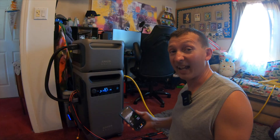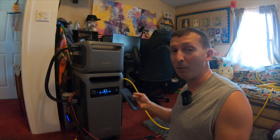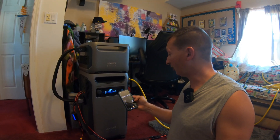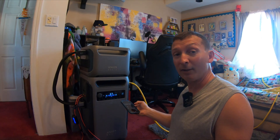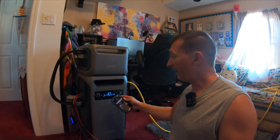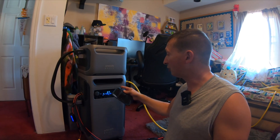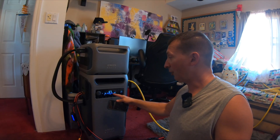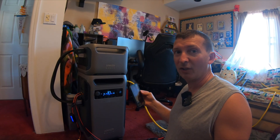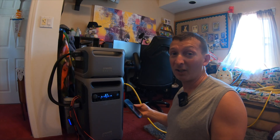Today is the next day. At about 7:30 p.m. the sun went down enough that I put the solar panels away. Results: during the day with solar, I ran the unit for 7 hours and 31 minutes. After cooking dinner and everything else, I was still at 90% charge. Then I ran my house for another six hours just off the unit, taking it from 90% down to 30%. The wattage draw was typically 430 to 700 watts during that time.